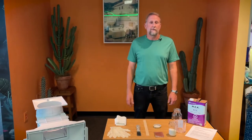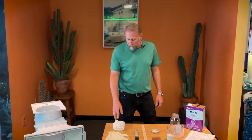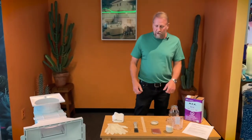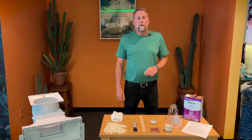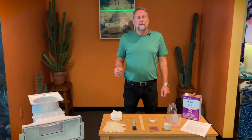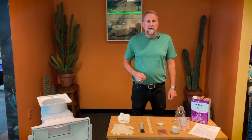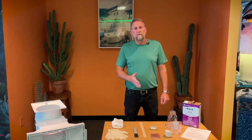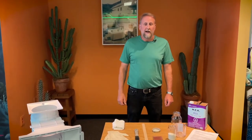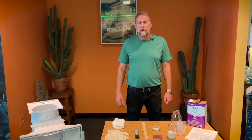It is important when doing this repair that we do not smoke — methyl ethyl ketone is highly flammable. Also make sure you wear gloves; you don't want to get schmear on you as it is messy. If you do get it on you, wipe it off with methyl ethyl ketone on a rag. The thicker the schmear, the longer it will take to cure. It does dry quickly and gets hard fast, but it is not fully cured. I recommend giving it 24 hours before putting it under water, to make sure the schmear has fully cured and bonded to the skimmer.